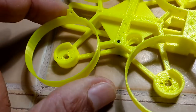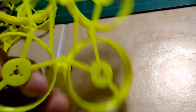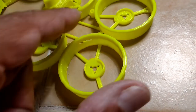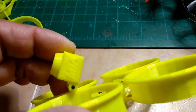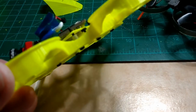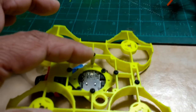Here's another frame with circular protectors rather than full ducts. And here's one with the camera mounted on top — it has an airfoil and came out at about 14 grams with the little camera mounted up there. The camera is hinged and slides in, but the board fit was a little tight. It's almost the same size as the original Mobula 7, but I don't like cameras mounted on top because it gets bulky when viewed from the side. I prefer this new setup where everything is more compact.